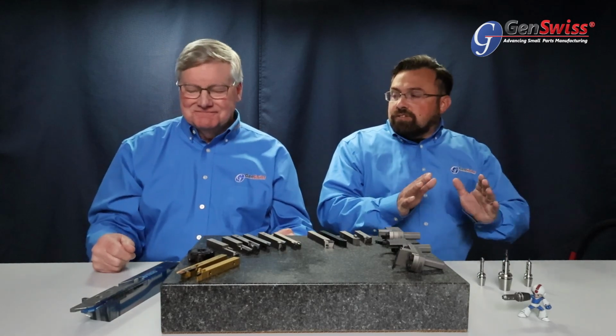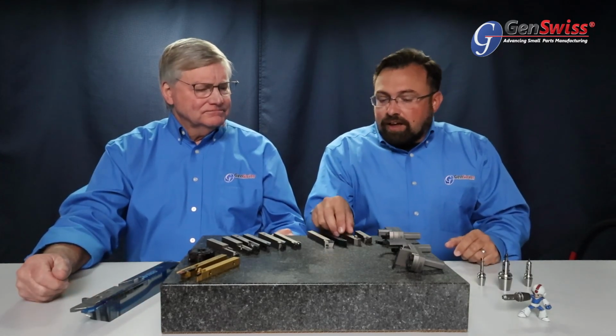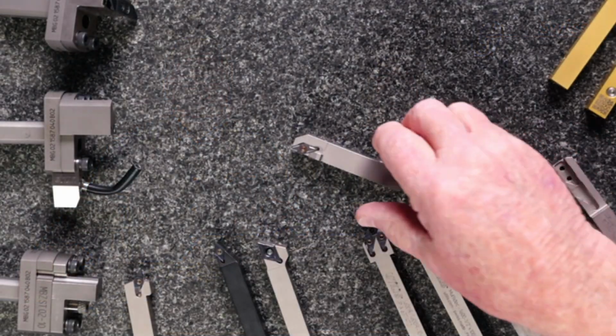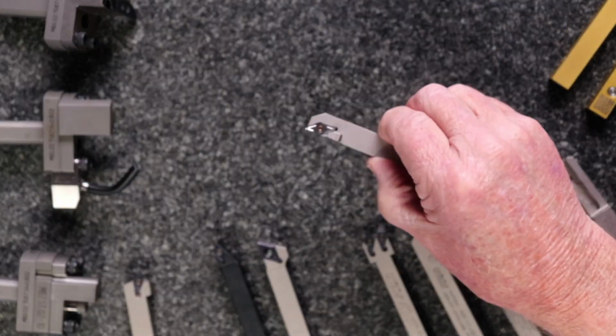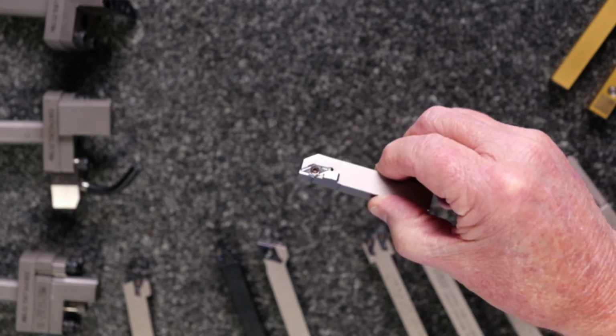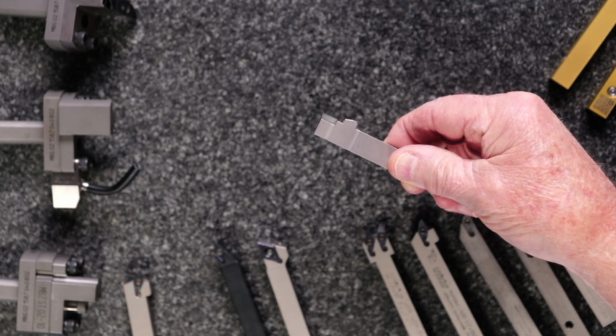All right. So one of my favorite products to recommend to any new user who hasn't used a Utilis product prior is the Multidec top series. We've actually got one right here. This is a standard front turning tool that would be simply used to turn diameter from a large size down to a smaller size. But the real trick about it is it's a wiper insert. It does a really good job of maintaining a very good surface finish while letting you run pretty aggressive speeds and feeds.